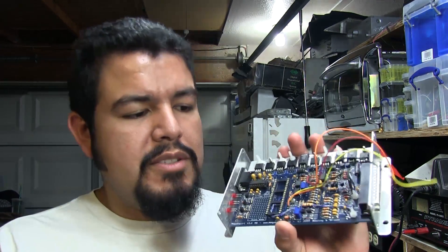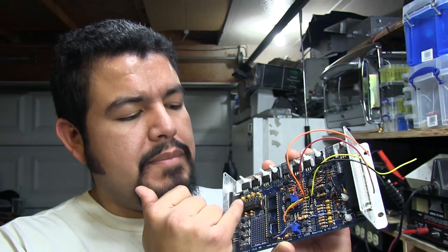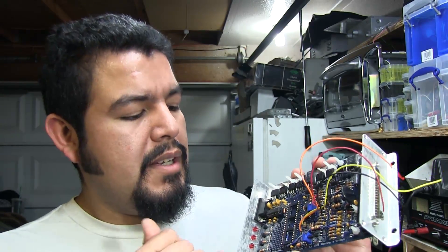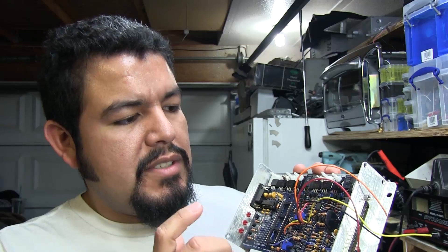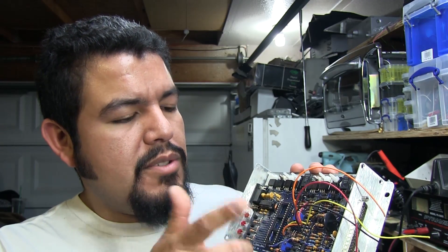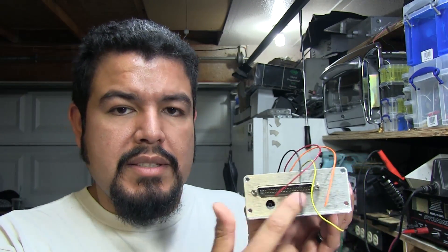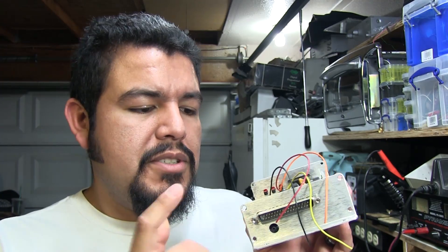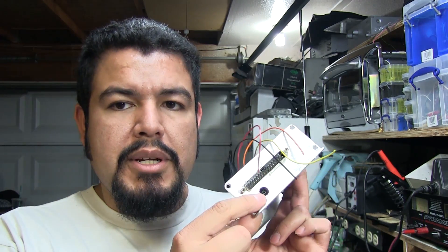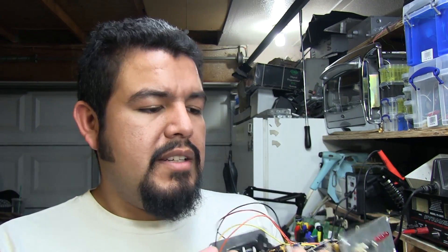The main board has all the other support circuitry. It's got the voltage regulator for the CPU, an RS-232 interface chip — that's a MAX-232 chip — MOSFETs that drive the injectors, and the transistor that controls the ignition coil. On the rest of the case we have the main input-output connector, where you hook up your sensors, injectors, ignition coil, and all that. It's got a MAP sensor on the bottom right here. The other side has the RS-232 port and some status LEDs.